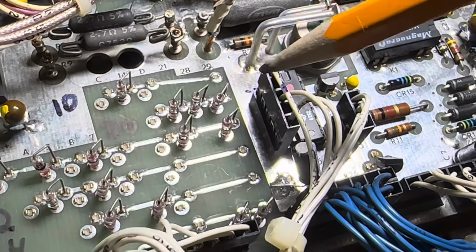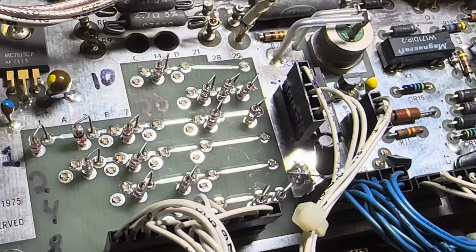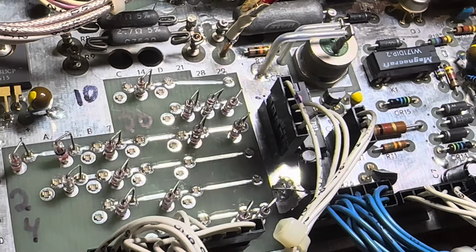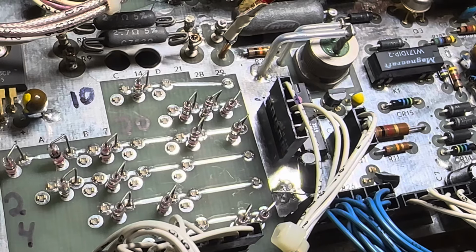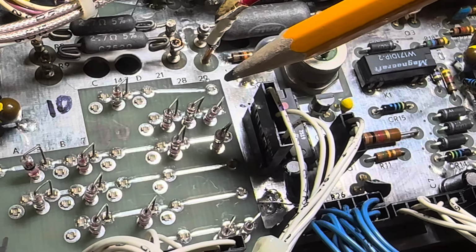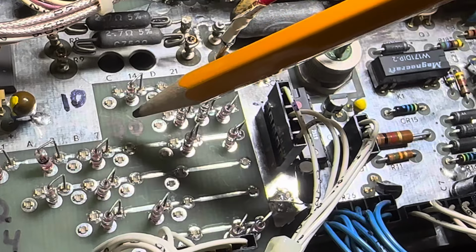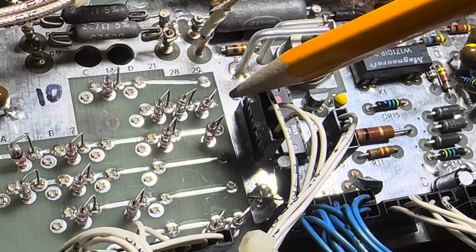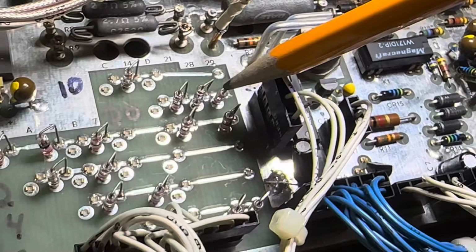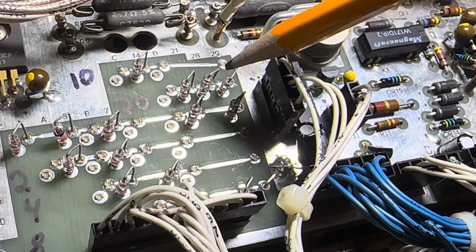And you might ask, how does this work? So these diodes all assign weight or a number to each of these, and that number has to add up to the starting number of the band in which you're interested, and these all go in 1 megahertz swaths. So for example, here's 29. So we know that 29 takes the 20 number. So we start with 20, we say 20 plus, and then you better get 9 here. How do we get 9 here?